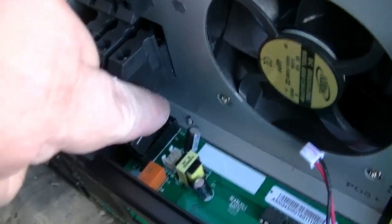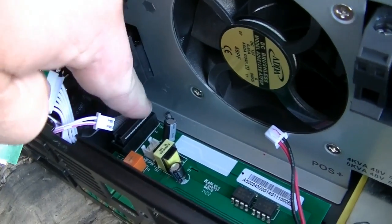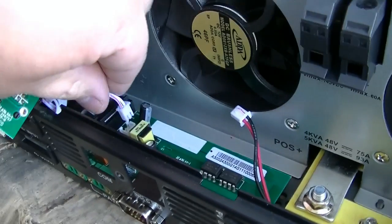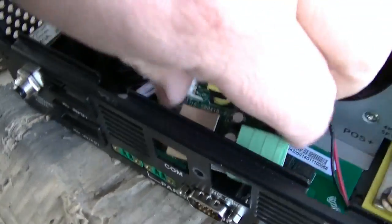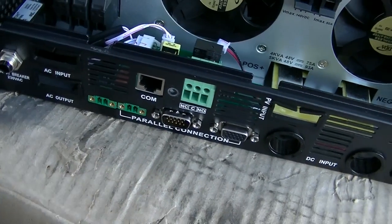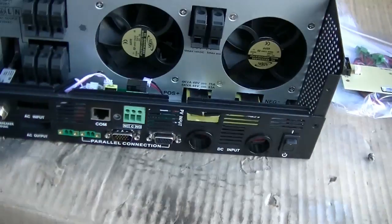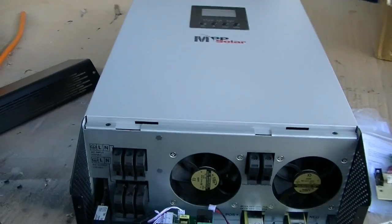This cable goes in here — don't bend any pins, just push it down gently. This cord on the other one goes on that side of those wires, so you plug that one back in there. The generator start and serial port connections go back in the bottom, do them up, and then you're pretty well ready to connect them in parallel. That's my demonstration of putting the parallel control board in the bottom of an MPP Solar inverter. See you later YouTube.